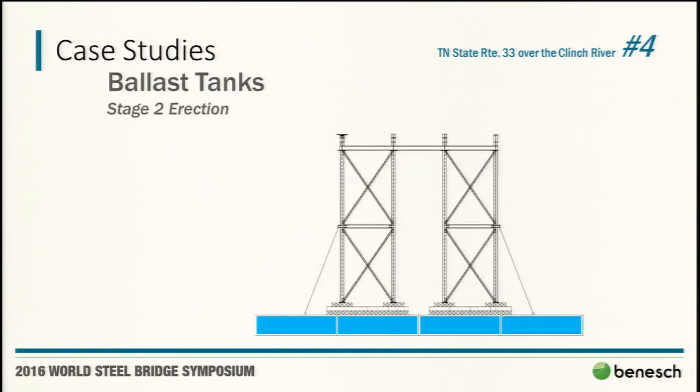So what are the steps? Again, you need to be very, very clear to the contractor. First thing you need to do, build your shoring tower on your barge and fill everything up, full load, when you get it out there. Get it into position. Obviously, we did have anchor lines on there. They'd used anchors for stability before. We were relatively comfortable with it. When we were doing the picks and the ballast, there was a tug on site as well, for added stability.